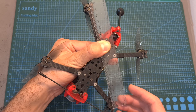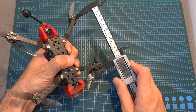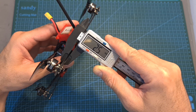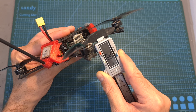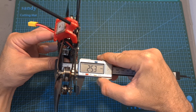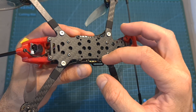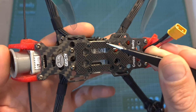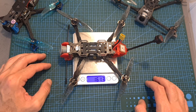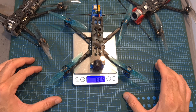As for the frame, which is by the way available separately, its wheelbase is 174mm. It features a dead cat pattern, so the propellers are not going to be in your FPV feed. The thickness of each replaceable carbon fiber arm is 2.5mm and its width is 7.7mm. The thickness of the bottom plate is 2mm and the top plate is 1.5mm, with 25.3mm between them. The bottom plate has 20x20mm mounting holes, and so does the top plate. The weight of the Crocodile Baby without a battery velcro strap and battery is 161.3 grams, making it slightly heavier than the Flywoo Explorer and lighter than the iFlight Chimera 4.